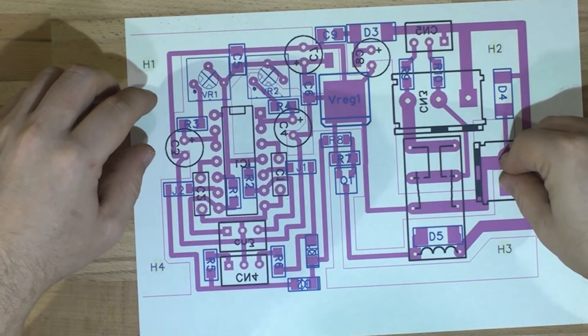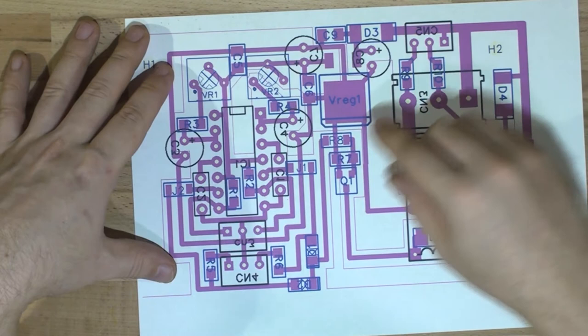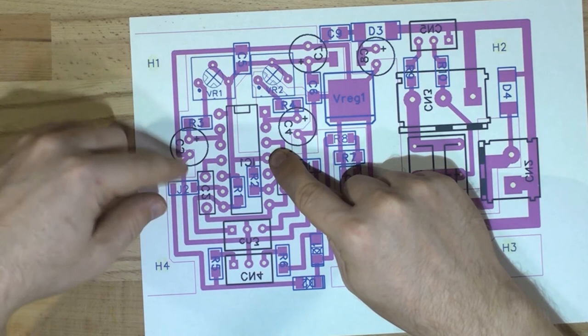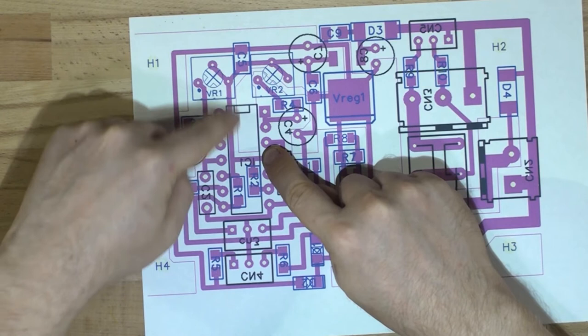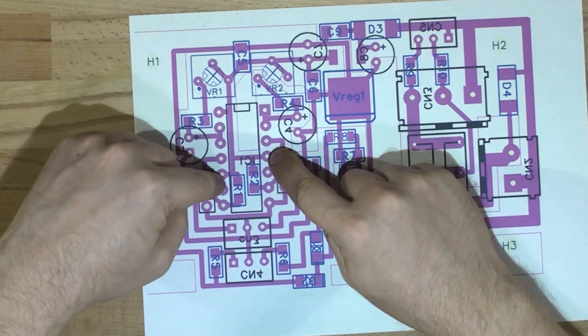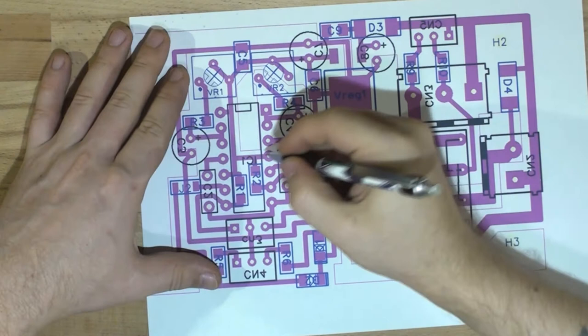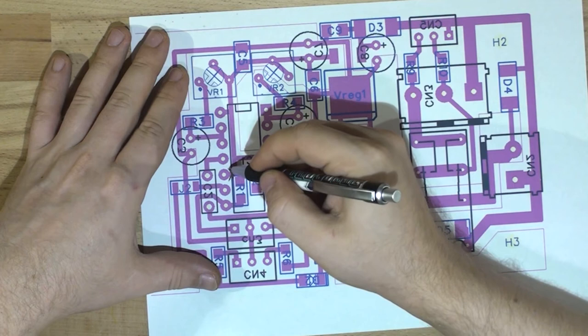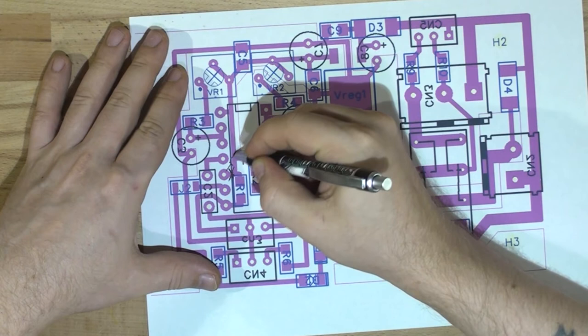You may find that when you power the board up, a dirty power supply can false-trigger the timer. To prevent this, disconnect pin 4 and pin 10 from the 5V supply. Then reconnect each of those pins to the 5V supply through a 22k resistor. Also connect each pin to ground through a 1 microfarad capacitor — that pin will need to connect to the supply through the 22k resistor.